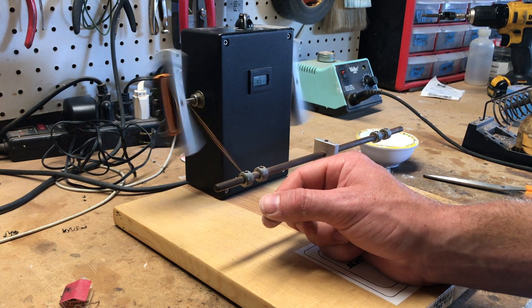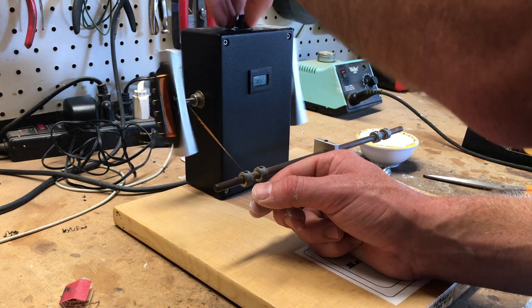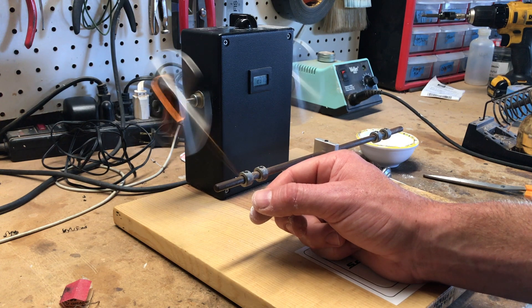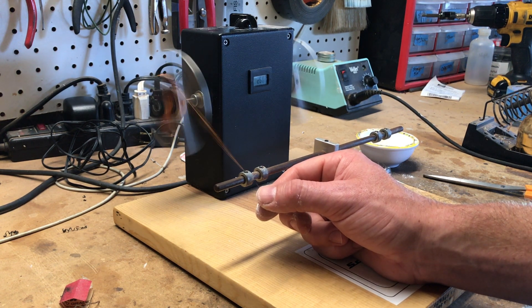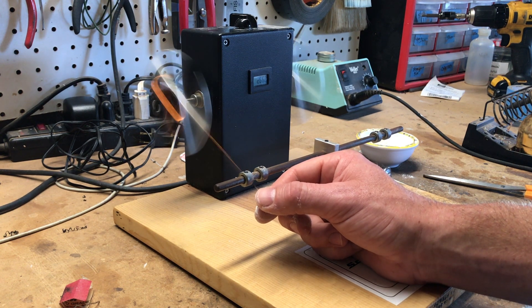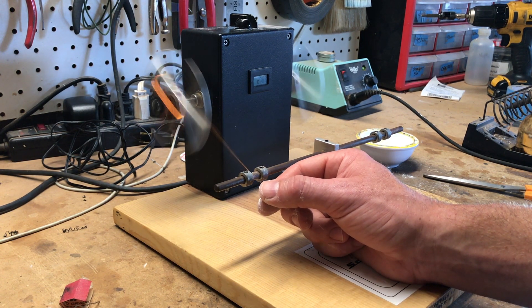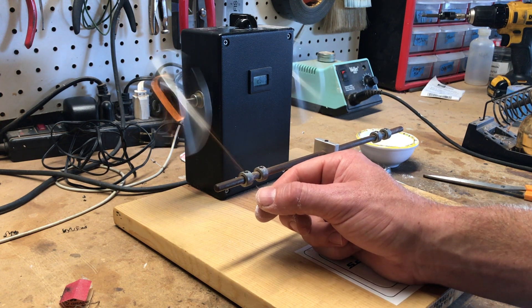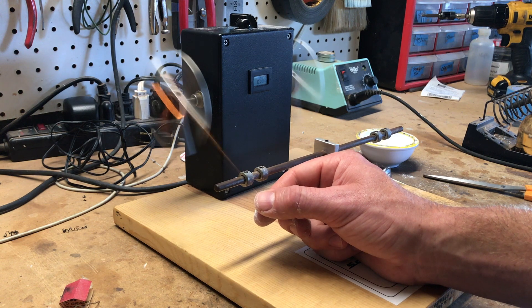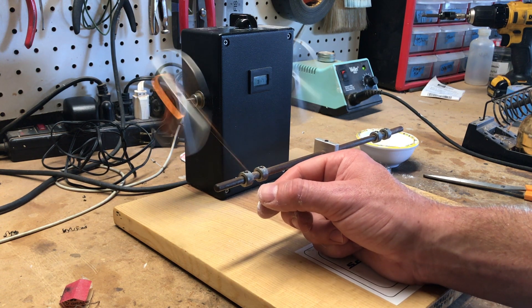Checking my winds — it's a little light in the middle, so I'll make the process more even: go slower in the middle and faster around the top and bottom. I'm going to do about 7,600 winds on this pickup. The old pickups — bridge, middle, and neck — were all wound exactly the same: same number of turns, same winding direction. They average around 5.7k, some as hot as 6.2. I found 7,600 turns is the magic number for that output.